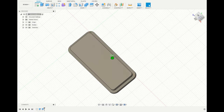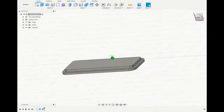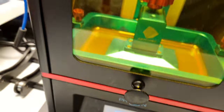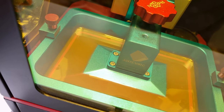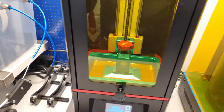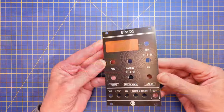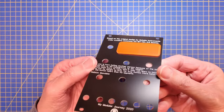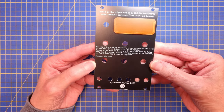While I was waiting for the final components to arrive, I started to think about adding a lens to the front panel. I have an MSLA 3D printer that uses UV light to cure resin, and for this project I'm using transparent resin dyed with orange ink, because the displays I'm using are sort of red-amber in color. This is what the lens looks like after washing and final curing — the surfaces are a bit rough, but that is something I will fix.